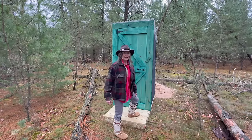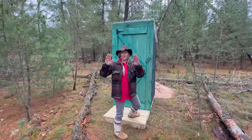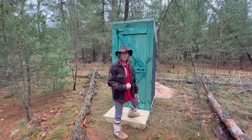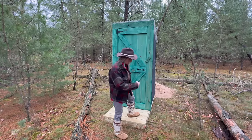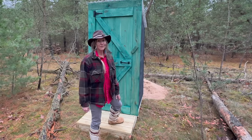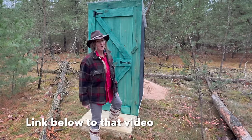It's a good idea to think ahead — if you plan on moving your outhouse periodically, put it on four by four skids with a little bit of an angle cut into the front so you can hook on to this outhouse with a skid steer or something and pull it forward over a new hole that you've dug. Otherwise you're going to have to get really creative in how you're going to move this outhouse to a new hole. We've had to do that once or twice.